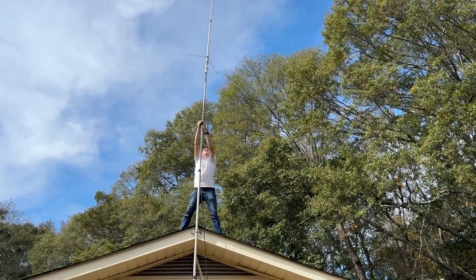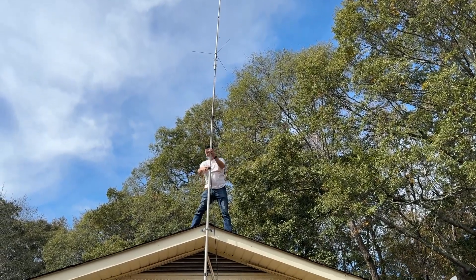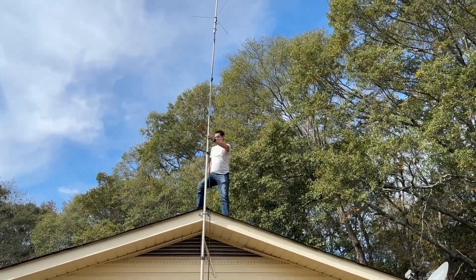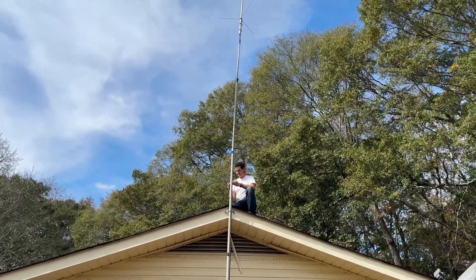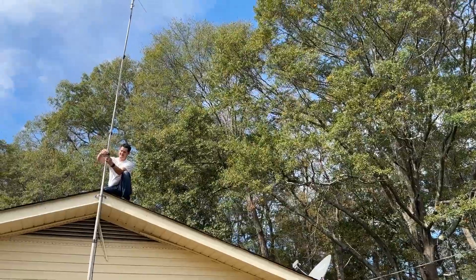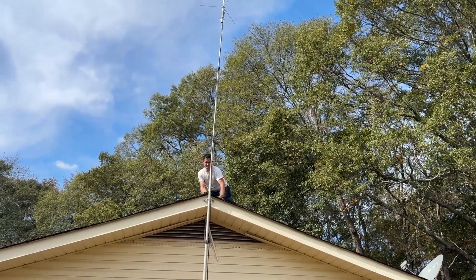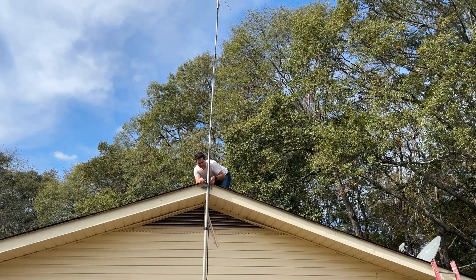So we did some tripping of repeaters and some tests to find the best height, and it was not to be fully extended but slightly below fully extended. Joshua marked that with a Sharpie so he could put it right back where it was as he tapes it — tapes the coax there. You can see all the foliage back there, the trees. We're not able to get this antenna above the trees, so you have to play with the height. We had particular repeaters we wanted to get Wendell into, so we messed around with the height up and down. You might take a little one S-unit loss on one to get the other — that kind of thing.